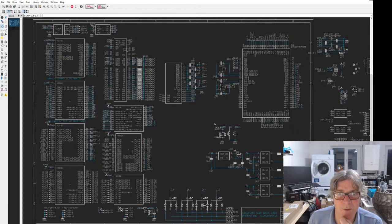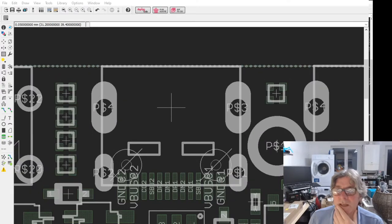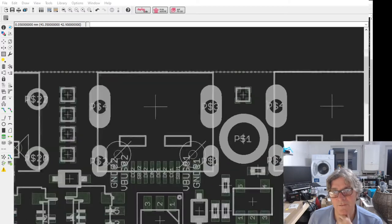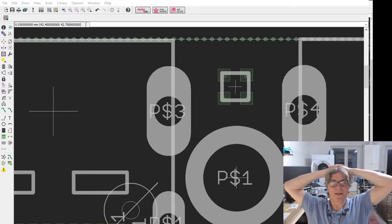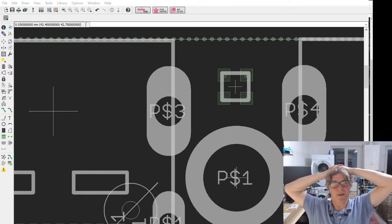Now, the LEDs I'm using here are these tiny 1mm RGB LEDs. They are teeny, teeny, tiny. Let me just take you back to the schematic and you'll see what I'm talking about. If we zoom in on this, we're using 5 of these. 4 for those elements that I'm just wiring up now on the schematic, these 4. We also have another one on the other side of the USB, which is the status LED for the system. That has 3 RGB LEDs in it, which are controlled by the done signal from the FPGA, which is also read by the STM32, the program signal from the STM32 to the ECP5 to say whether it's programming or not, and the status signal from the STM32, just in the same way we had a status signal on the Black Ice MX. So it's very similar in terms of color.